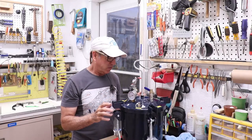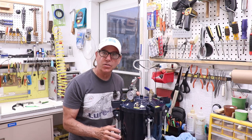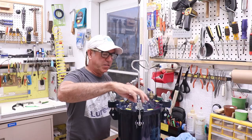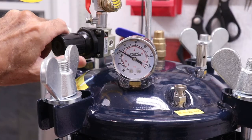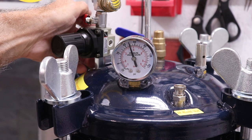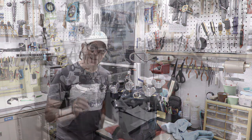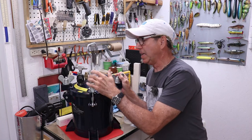I do want to test it to make sure there are no leaks. So the first thing I'm going to do is pressurize this thing to 50 psi, close the valves off, and see how well it holds that pressure over the course of an hour or so. Tighten the opposing fasteners at the same time — torque them down and then torque down the ones opposite each other. If you don't have a shop compressor you can use your airbrush compressor or even a tire inflator; it'll just take a little longer. All right, that's 50. I'll shut off the supply air. It's been a little more than an hour and a half and it looks like it hasn't budged — I don't think we've leaked at all.